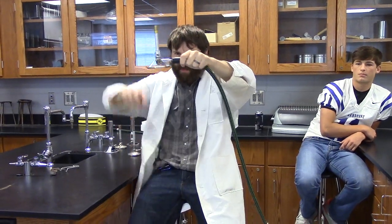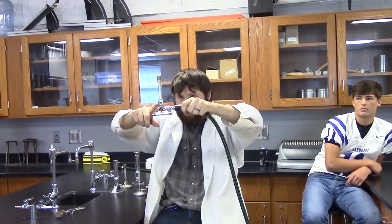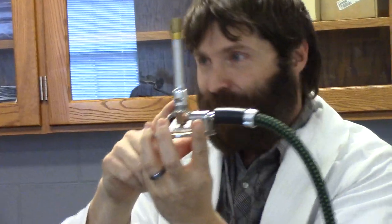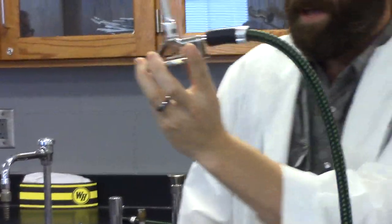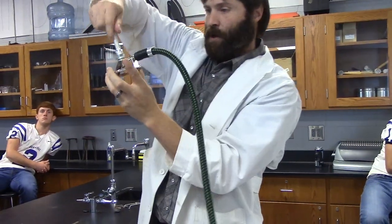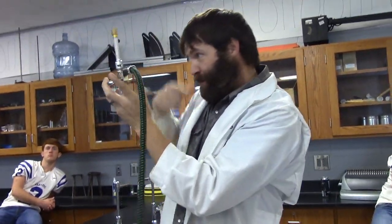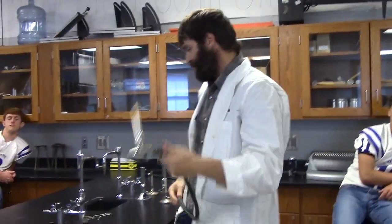You need gas, and you also need air. You can see all the air that's getting into it. I'm going to close the air off of this burner - you can tell the air is closed off because you can't see into it anymore. If you twist it open and can see through it, you're getting air. If you don't want the air, close it down. It's always easier to light without air.